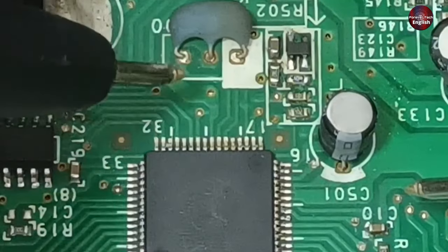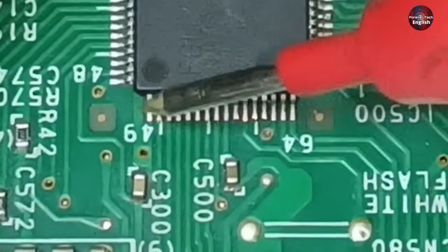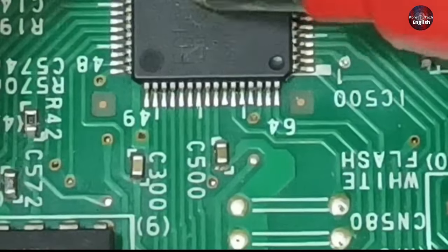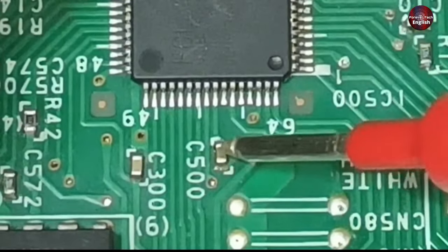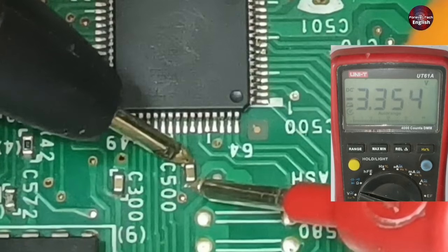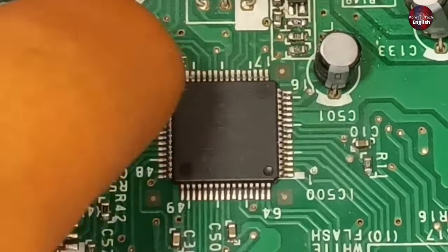The next pin is number 24, which is the ground pin. I will place the second probe on the point of pin number 56 — 5 volts are also present across these pins. Checking this capacitor, which is used to stabilize the microcontroller voltages from any fluctuations — 3.3 volts are passing across this capacitor. This means that the voltages that make the microcontroller work are also fine.